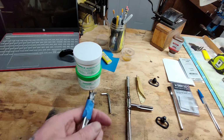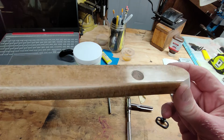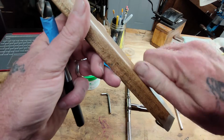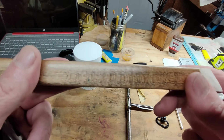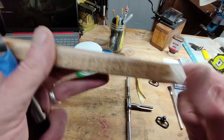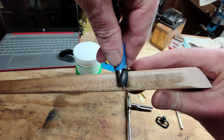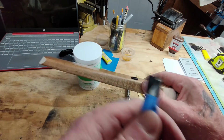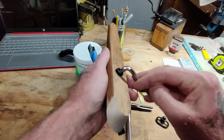So the next thing I do, just to prep before I touch the real stock, is I did all these steps for the drilling and the tapping on a scrap piece. I drilled it, tapped it, and then I screwed in my part, and I saw that, hey, I didn't make it deep enough. It's still not where I want it to be, so I adjusted my tape back that distance that's sticking up here, so that when I drill deep enough the next time, I'm down all the way, and on the real piece it'll be good. So now that we have our drill marked and we know our depth, let's go out to the drill press and get the stock drilled.